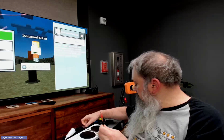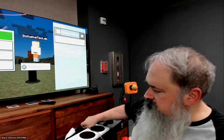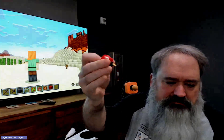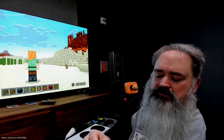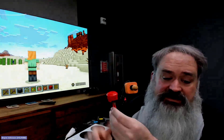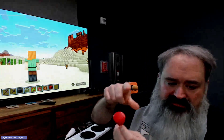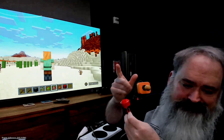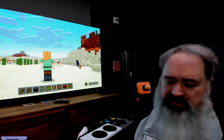I'm going to remove it from that port and plug it into the A port. I'm going to take this arcade button — you can get these on Amazon for about a dollar fifty — and plug it into the connector ports on this wire. All a normally open switch does is finish the connection, and that's what fires the button — just like touching the wires together. When I press this button, Alex should jump up and down. That's what switches are — they're not really that complicated, but what you can do with them tends to be pretty powerful.